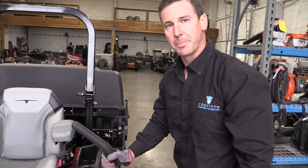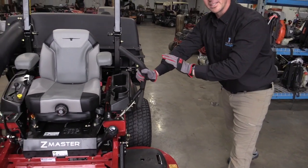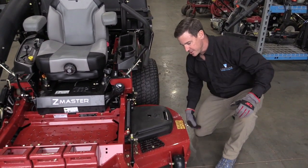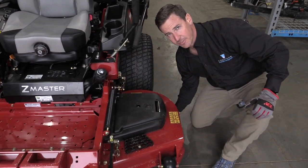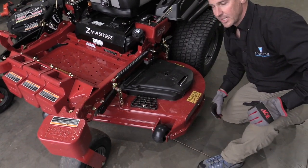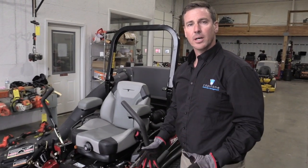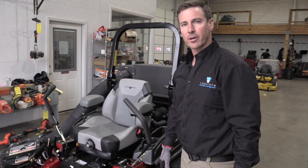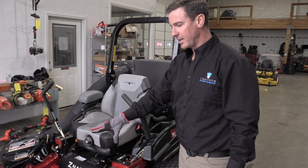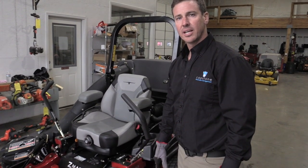The next step in a post-inspection is making sure you have your gloves. Again, the engine is off, the parking brake is on, and making sure your deck is clear from any grass, leaves, dirt, or debris. Then your mower is ready to be stored. Pull it into the identified parking space labeled 60 for the 60-inch mower. Make sure it's in between the two yellow lines, and you're done for the day.